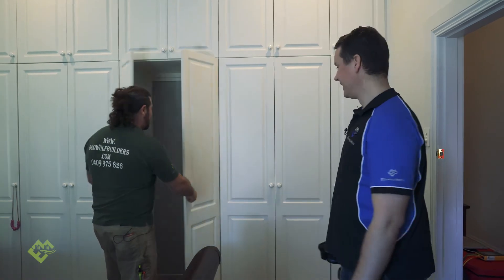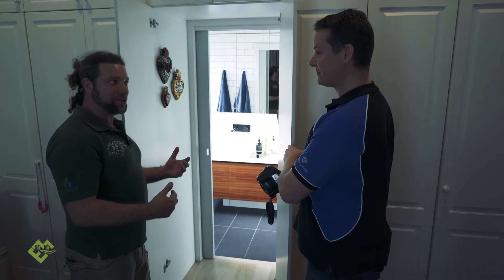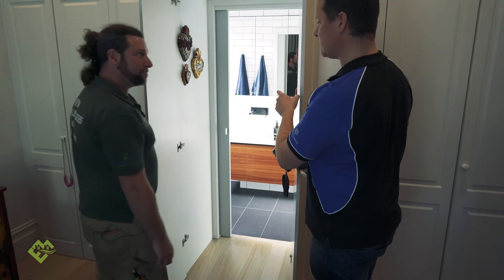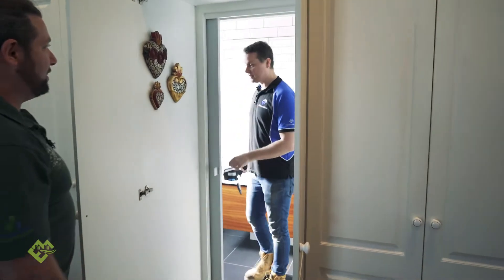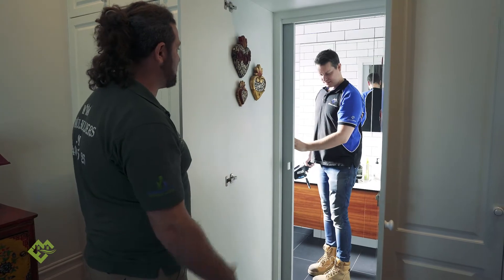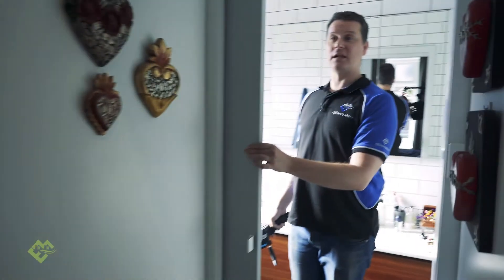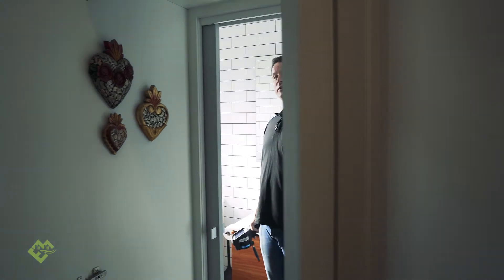This is one of my favourite things — the internal wall cavity door units that leak. So come and check this one out. The parents' escape — no longer do you need to hang out with your children; you can run away and hide! Normally these internal cavity sliders leak a lot. Can we run the fan and see if this one leaks? It's not going to leak, John. It's an internal wall so we've sealed it as we've done it. When we stand up our walls, we actually seal underneath and on top. Normally these are automatic closes — when we put induced negative pressure they automatically close.